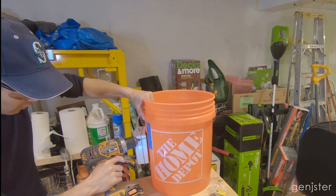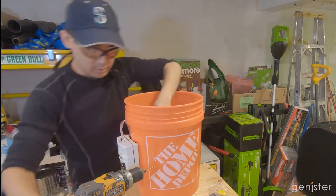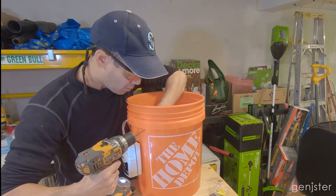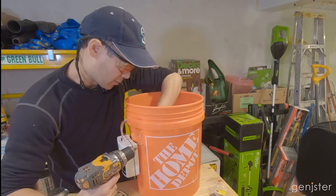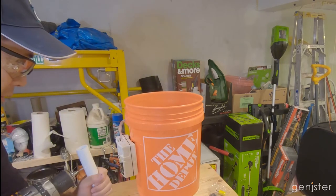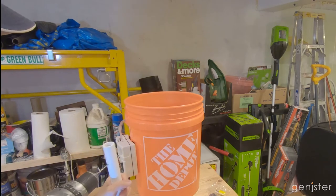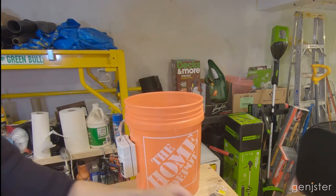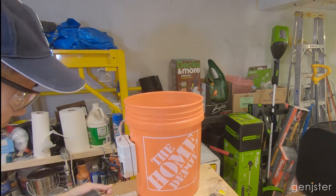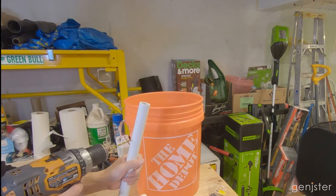I start off with a smaller drill bit to make the pilot holes. Now that I have the two pilot holes, I line up the pipe by eye and make sure I drill right in the center of the pipe. I go into the second hole and make sure everything is lined up. Both holes are nicely lined up, and I want the hole to go all the way through now. I want to make sure the drill bit is lined up with the extension hose at the bottom. Then I'll switch to a drill bit that's the size of the number 10-24 screw I'm about to use — slightly smaller than the thread size so it creates a nice tight fit.